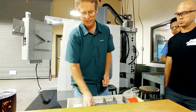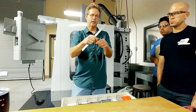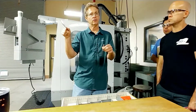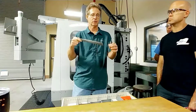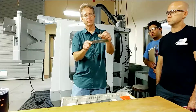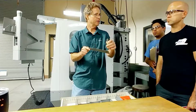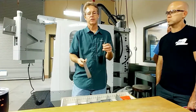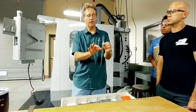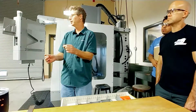We used to do this project with a wiggler, and wigglers can be very handy. They're just a pointer — you turn on the spindle and you straighten out the wiggler. When you straighten out a wiggler you always want to use a scale, a 12-inch scale. You want to keep your hands and fingers away from that point. You angle it about 45 degrees while it's spinning. Once you get the pointer going straight you can turn the spindle off — you don't even need it on anymore. You see some tool makers in shops when they turn it on they just grab it and point it straight.